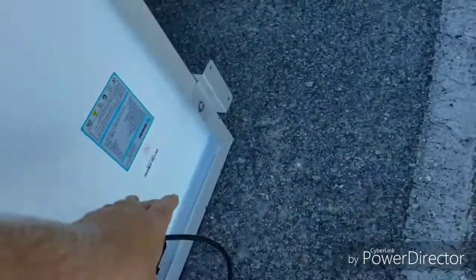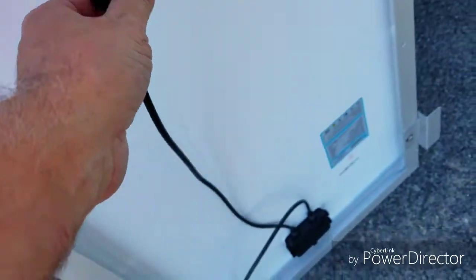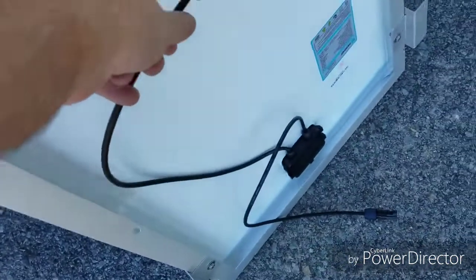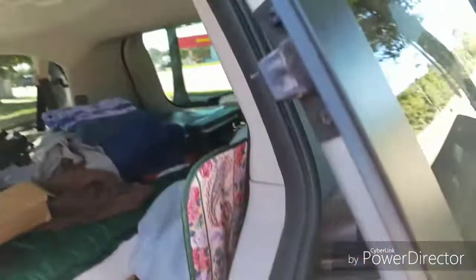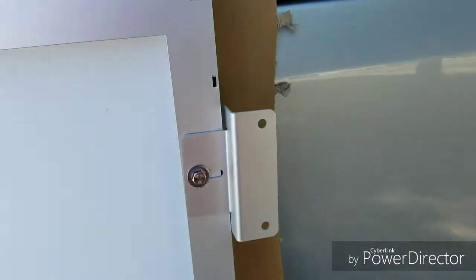The only way you can tell the positive side is it is the male side of the panel, so whatever you connect to that is going to be positive. With my adapter cable you have to keep that in mind — follow that line and make sure it's the same line, you don't want to mix them up. I've also scuffed up the brackets on this side and put the tape on first.